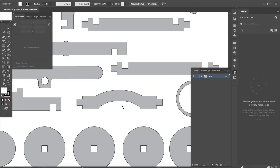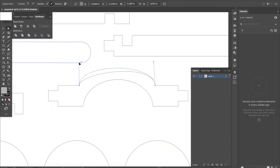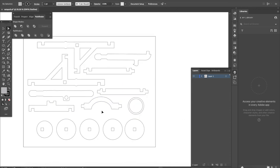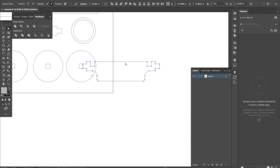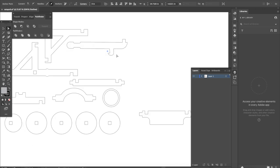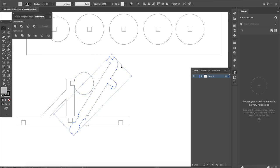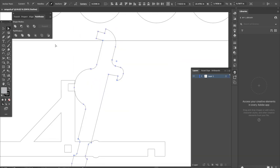Okay, we open up the old file from a couple days ago. A couple of the first things I wanted to do, I needed some more clearance in this cross member. So I just use a shape to cut out the scallop, and then I use my Bezier curves. Use the point selection tool to reveal your Bezier handles. And now I'm combining some parts to make the switch area and the back axle thicker. I'm improving the hook on my lever arm, and I'm checking its incident where it will approach the cross member. Put a stopper on there like I put in the last one.